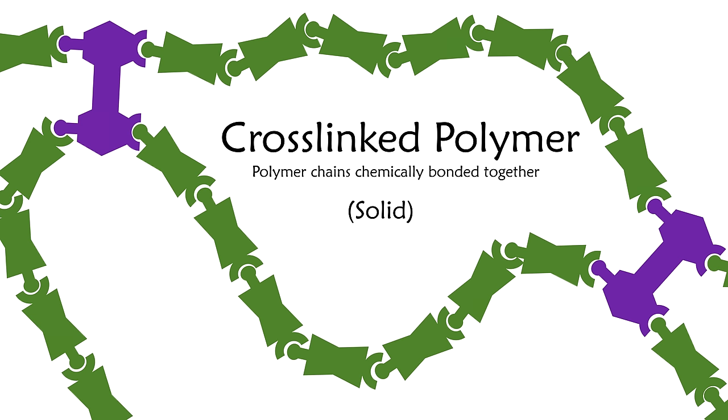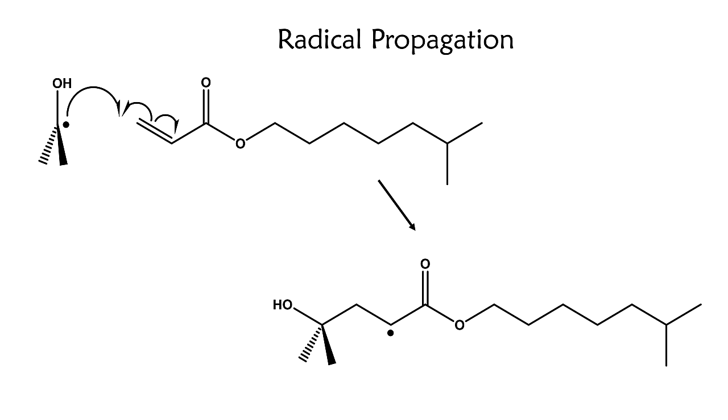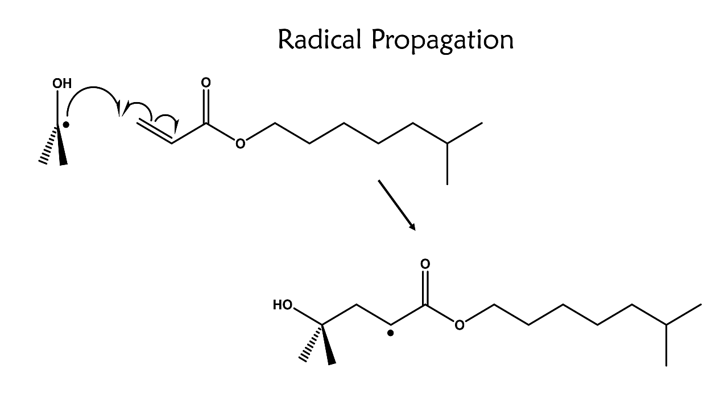Since we know the ingredients of the Anycubic Eco Resin, here's a real example. The initiator molecule starts with 188 electrons — even number. Covalent chemical bonds are the sharing of a pair of electrons. UV light can cause a cleavage of a carbon-carbon bond, leaving one of the two bonding electrons with the big fragment and one with the smaller fragment. These radicals are just stable enough to form but still quite reactive. When a radical collides with an acrylate group, a reaction can occur. That unpaired electron and one electron from the double bond in the acrylate group form a new carbon-carbon single bond, linking the radical to the monomer but leaving behind a new unpaired electron. Our product is still a radical, still reactive — the chain reaction has begun. Monomer or crosslinker units keep getting added to the chain.